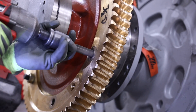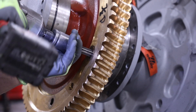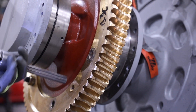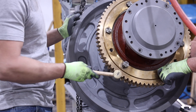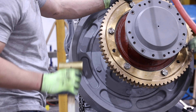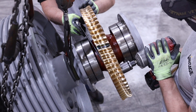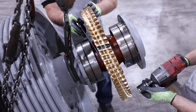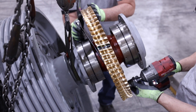Mounting of the gear can be resumed if the gear has adequately cooled. Ream the four body bolt holes through the gear and gear hub that do not have the temporary clamping hardware installed. Install the four new body bolts in these four holes so the nut is facing towards the traction wheel. Tapping the body bolts to install them with a soft hammer may be necessary. Remove the temporary clamping bolts and install the last two new body bolts in the same manner. Torque the six new body bolts in an alternating crisscross rotation to the value in the manual to complete the gear mounting procedure.